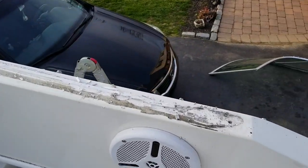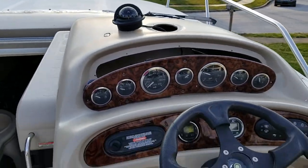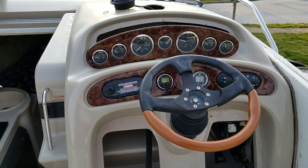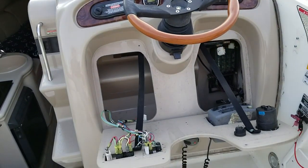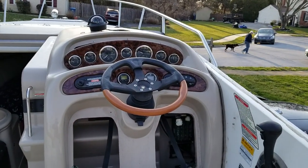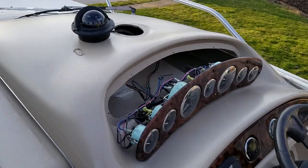Back up in the cockpit — this is where the windshield was. You can see the screw holes right here; I'll have a lot of work cleaning up the caulk but that shouldn't be too difficult. With the windshield out and all the brackets off, I should be able to get the helm out. My advice: just take your time and be slow when pulling the helm out — that way if you missed any wires you're not going to tear or cut them. To get to this point is really only about two hours of work. Had I been able to watch a video first, I could probably get here within an hour.